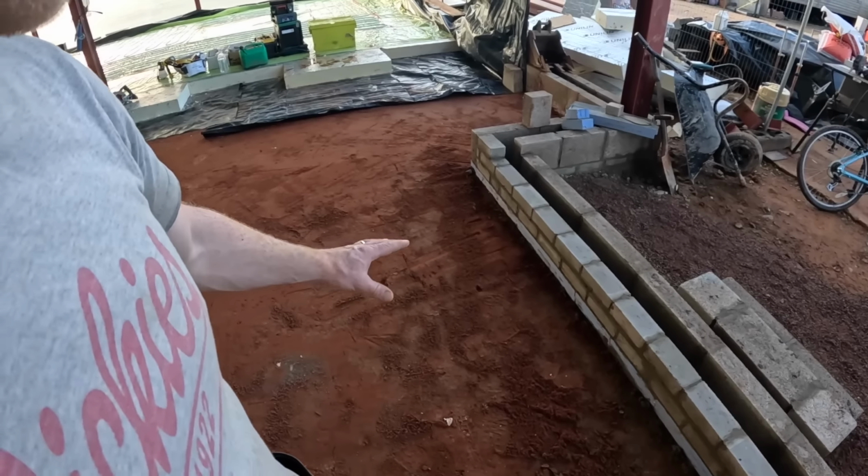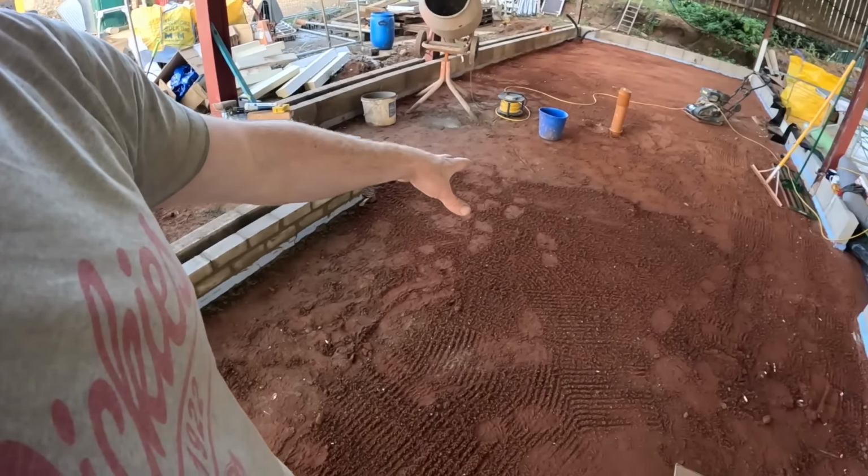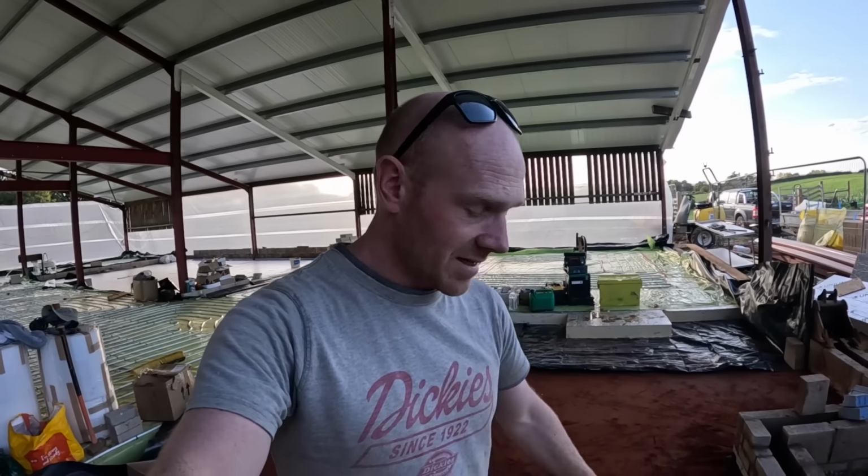And what this means now is this weekend I can screed away and get all this sand where we want it. Hopefully I've got enough. I'm going to use some building sand just to fill up a couple of the low spots, and then I can get all this insulation down. That's the only thing stopping us from getting six more loops of underfloor heating down this weekend.